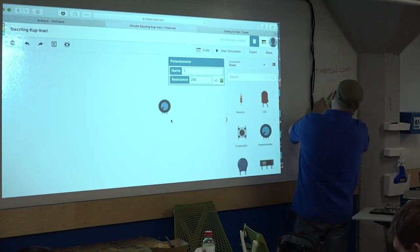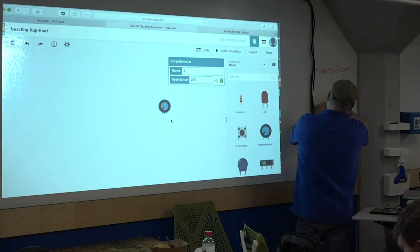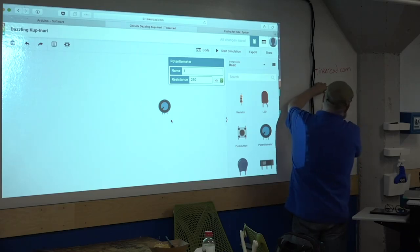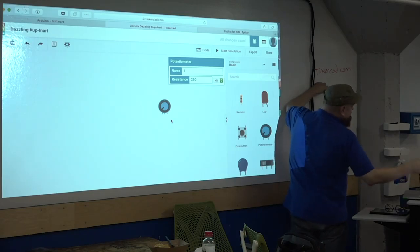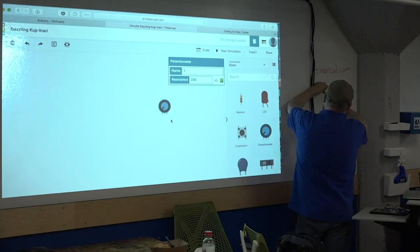So when you start out here, from here to here, there is no resistance. So it's almost just a wire, right? Zero resistance. But as you move across, you're increasing the amount of resistive material. And for this one that's up on the screen, it's like a carbon mixture that's doped with some other stuff. Back in the olden days, it was a rheostat. It was actually literally a coil of wire. They were big. Like in old homes that have dial or dimmer switches for the lights, those are still a coil of wire in there.